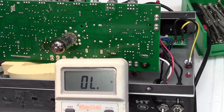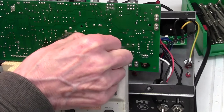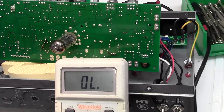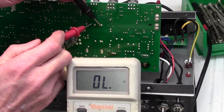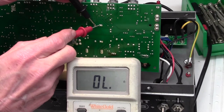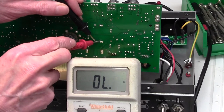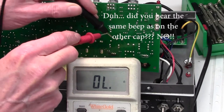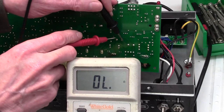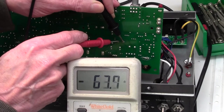Here we are on the side of the board again. I'm going to check the electrolytic capacitors. One is here, one is here. Two smaller ones are across here and across here. I've completely discharged them by putting a croc-clip across each one for a couple of minutes, because if there's even a tiny voltage on the capacitor it's very hard to measure continuity. We're looking for short circuits. That was charging up, so that's okay. And again, charging up — that's okay.